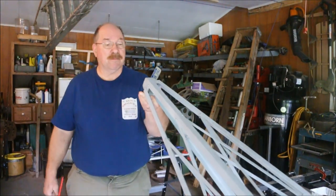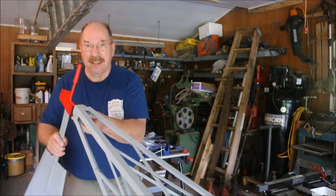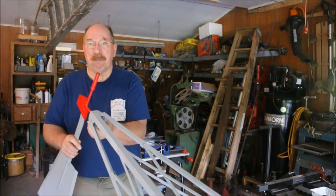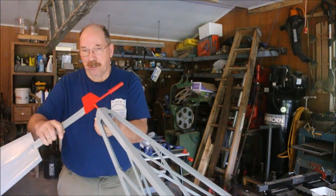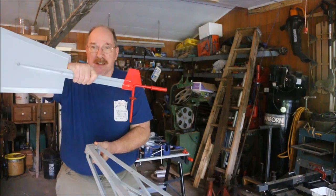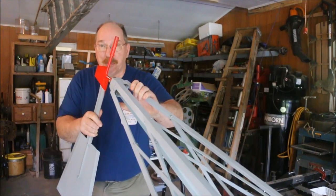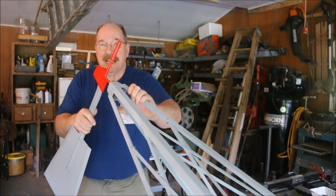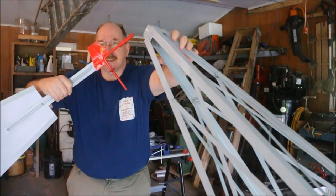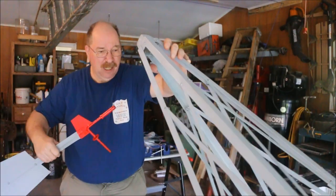The top of the tower originally had a single bearing in it, and that let this fan blade rock back and forth. With the fan wheel itself balanced on the shaft, this didn't move a whole lot because of the way the leverage of the counterweight worked. Over time, that bearing wore out and allowed this to droop and caused it to not be pointed into the wind correctly, and instead of sitting flat, the weather vane was actually sitting like this.